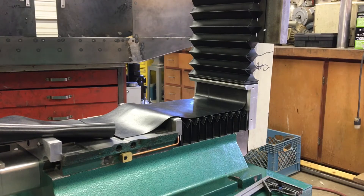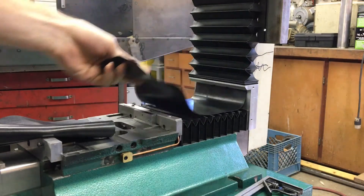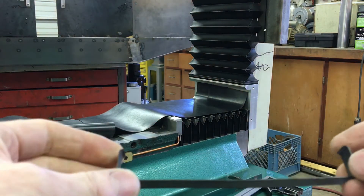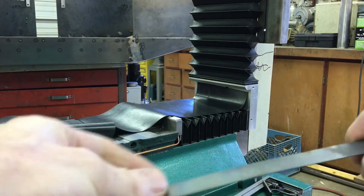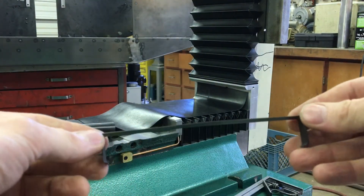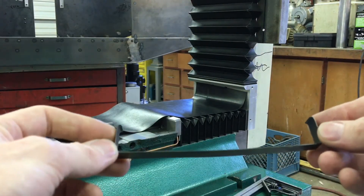So I got a piece of rubber — it'd be cool, a little loincloth — to keep the chips off, and it should be easy to lift up and blow out every once in a while. I found a piece of stock, 01 tool steel, and I bent it up into like a spring clip kind of thing. Then I hardened it with a torch, just all willy-nilly, and it actually works pretty cool.